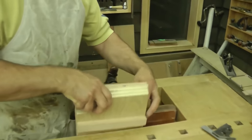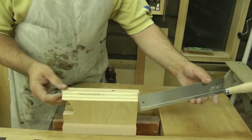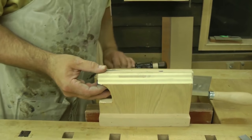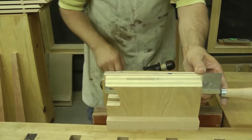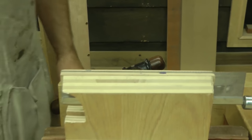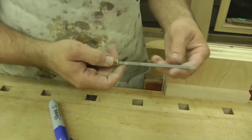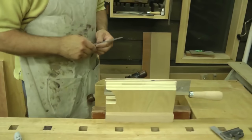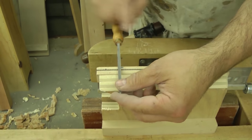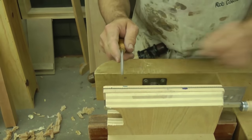The idea is to pinch the saw blade right up close to the teeth. Put that in the vise, put the saw in, and I want it so the teeth just clear the top of the vise — no more than about an eighth of an inch to the very top of the teeth. You want them well supported so they don't vibrate. For a file I use either a 5-inch or a 4-inch double extra slim taper file, which you can buy for $5 or $6. I want the face of the tooth filed perpendicular to the run of the blade, so there is no fleam or angle in the face of the tooth, and the cutting face standing at zero degrees — straight up and down.